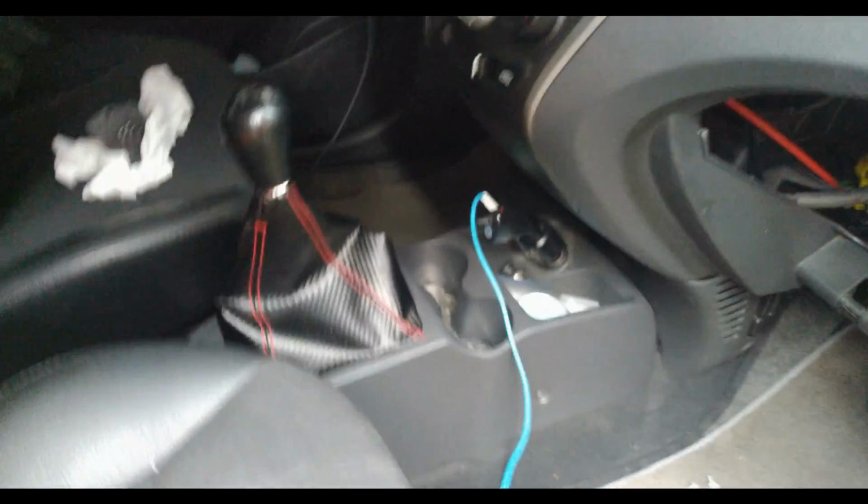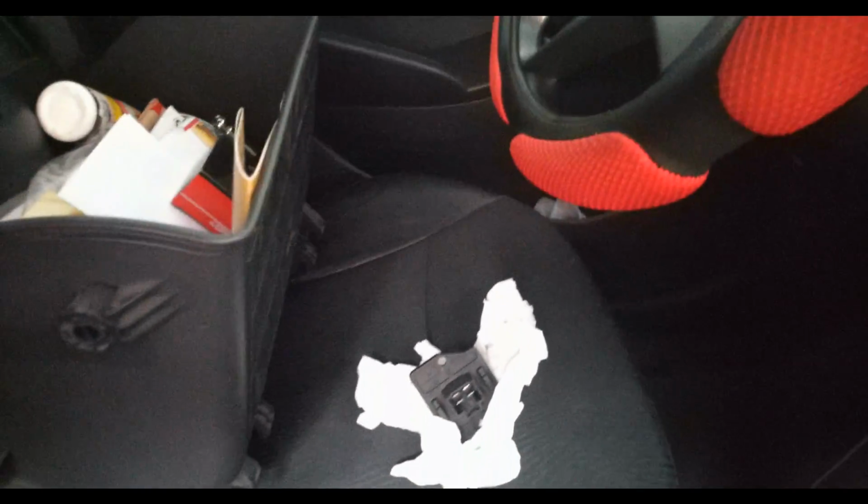This actually will be a bit thorough when it comes to the cleaning, but it's basically just the same as the ones I posted in the first two videos. But if you want to be thorough in terms of cleaning your evaporator or your AC system, you might want to do this, but please be very extra careful, especially when handling the resistor that's sensitive. If you mess that up, your air conditioning unit and your heater core will not work. So I already removed the resistor and cleaned it with some electronic contact cleaner.